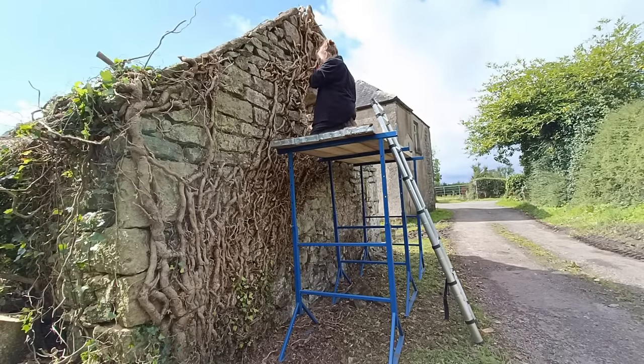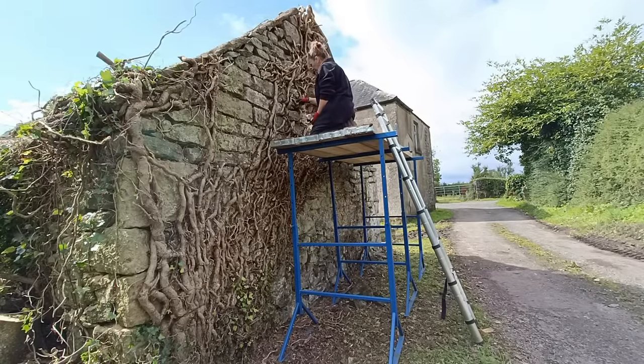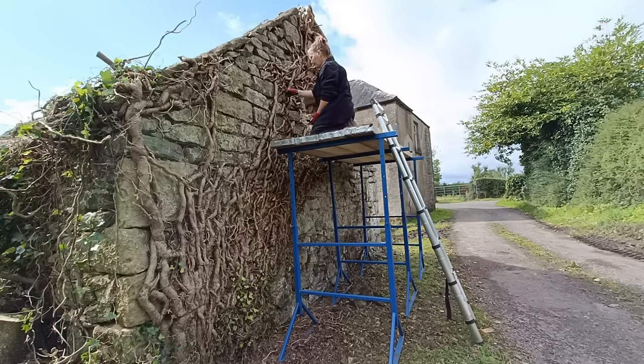So I do know I'm using, I think it was, 3 mil sharp sand and NHL 3.5, but I need to decide on the ratio.